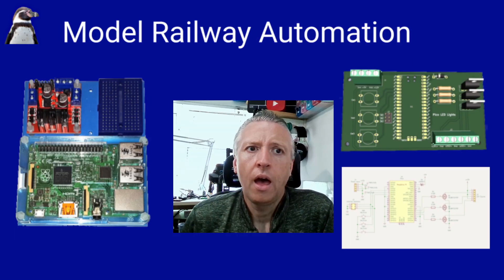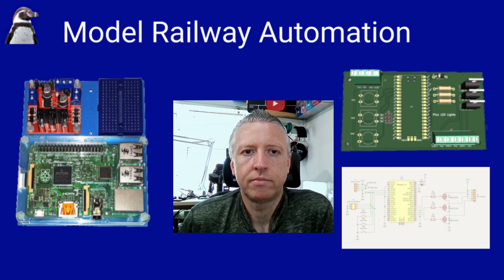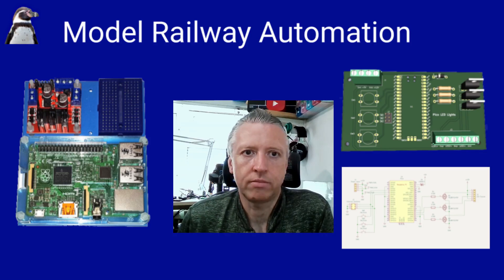Back to the concept of DCC - I was looking at implementing something using an Arduino or a Pico. The reason being that I want to be able to control locomotives using DCC, then using a Raspberry Pi or a microcontroller. It sounds fairly straightforward, at least in theory. Effectively, DCC is about encoding signals to the locomotives or accessories as PWM signals.